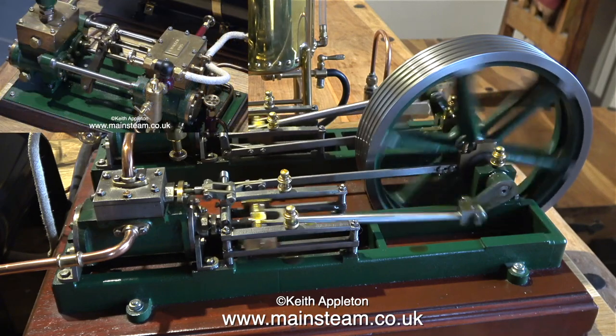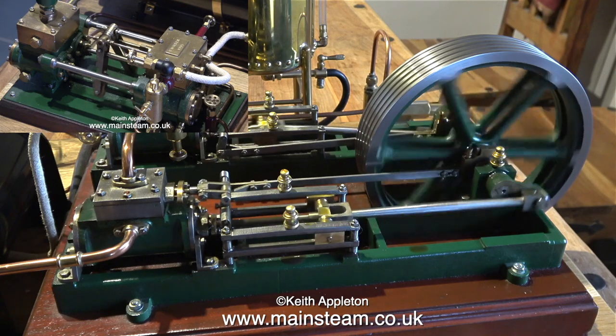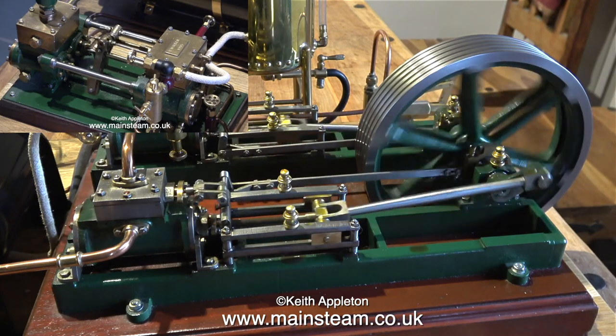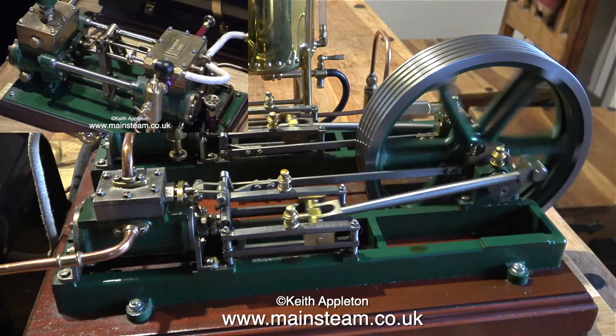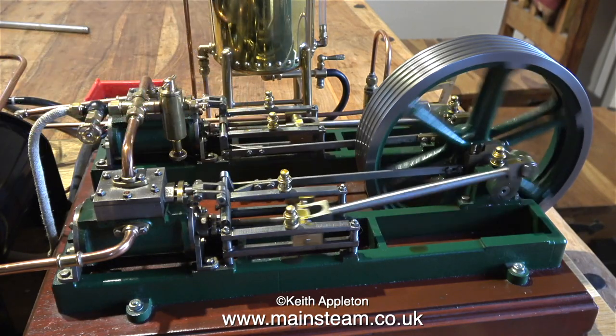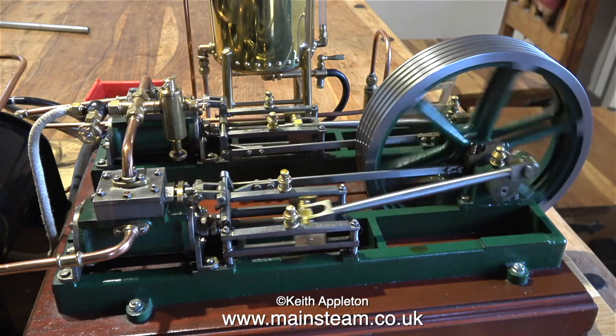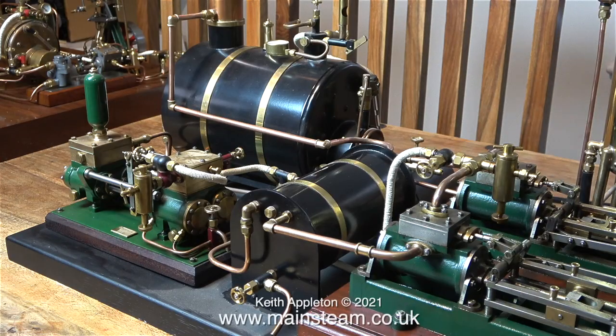This plant also has a Southworth Engines duplex water pump. This pump was built by a friend of mine, the late Bernard Walker. The customer for whom I assembled this plant has 2 young sons, so it never did a lot of steaming. They used to run it on compressed air, and the pump's steam cylinders probably never got any lubrication, so I'm going to change the rings and see what happens. If it's not that, it's a breach in the gasket on the steam chest. I will be making a video when I fix the pump, but I think I'll do that in the workshop.